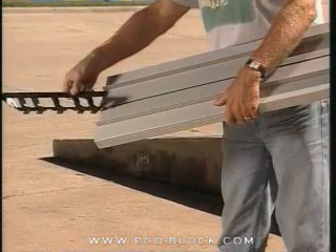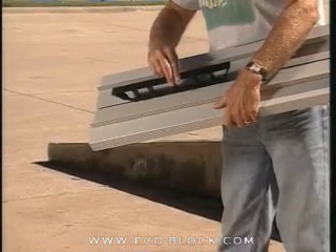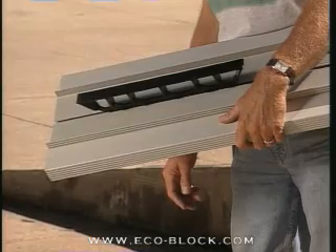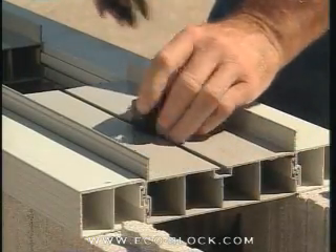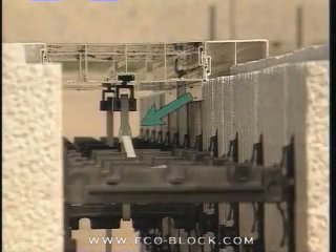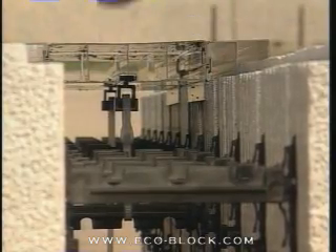Webs from scrap panels slid into the notch on the filler piece are ideal for securing ECOBUCK to the form. Using webs ensures that the buck will be fixed solidly onto the concrete core. When there is insufficient clearance or depth for webs, Texas Tees may be used. Make sure to pull the zip ties snug and trim off the excess.